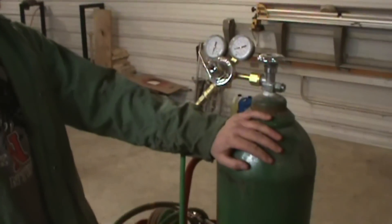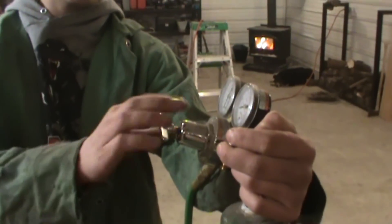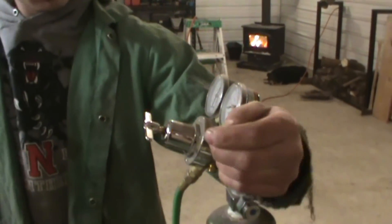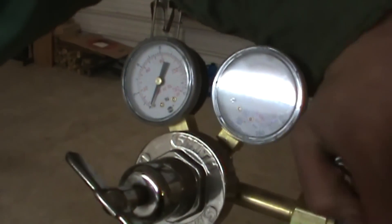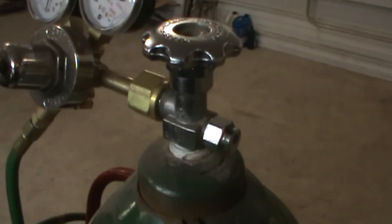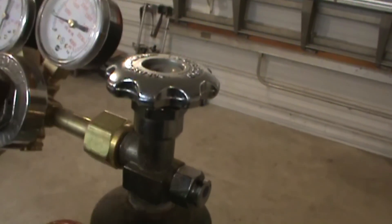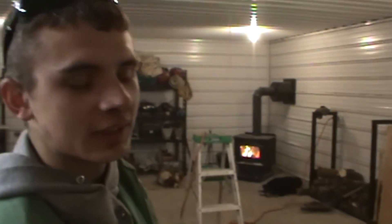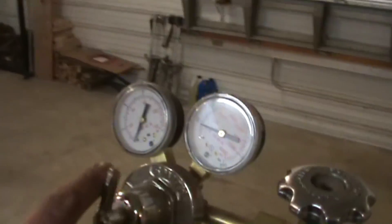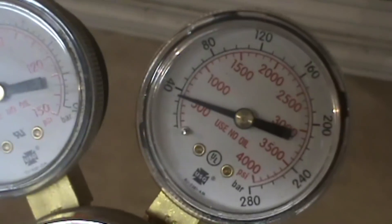So as far as setup goes, that's enough of a chemistry lesson for one day. You've got your oxygen here — this one's getting kind of low, but I'm going to go ahead and crack it. You always want to stand off to the side when you're opening these, because if something goes wrong and this thing flies out, you don't want to be in front of that. Open these slow. You want to open these valves all the way up. An oxygen tank or a C25 tank can seal leak-free in two positions: all the way closed and all the way open. If you only open it halfway, you can lose some gas from around up here. We're going to turn this up to about 35 psi as per the tip — so there's 35 on our oxygen, set up and good to go.